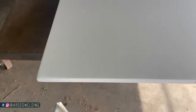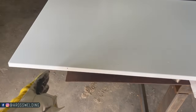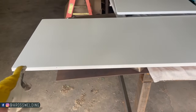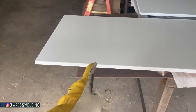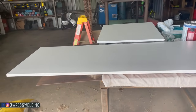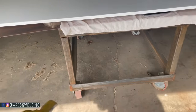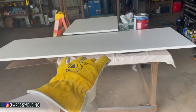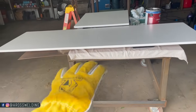It's going to be about 39 inches tall and I'm going to inset the square tubing a couple inches so you can't see it when you're standing at it — inset all the way around, then we'll screw the top down to it. Four down legs, and it'll be inset on one side for shoes. There'll be a couple of shelves on this side for shoes, so I'll make the square tubing come out here but the first down leg will be about 13 inches back. I'll put one rail in between back there, one on each side, but no rail across the front at the bottom so it's easier to get stuff in and out. Kayla's going to make decisions on shelves and we may put some doors or a curtain.